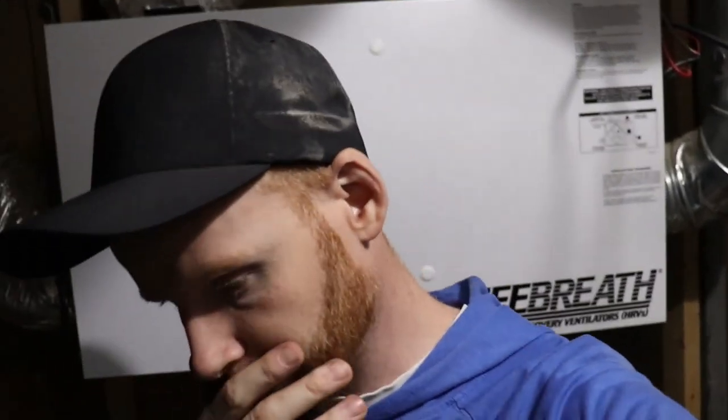But for all you people out there that have never drained your hot water tank, you want to do that at least once a year, potentially every six months. I haven't done it for 7 years since I moved in, and I didn't get that much sediment out of it. That being said, it doesn't mean that you shouldn't be doing it. Just to flush it out, it doesn't take that much. It's less than filling up a bathtub. Just drain it, flush it out, then you make sure that all that sediment and other buildup isn't in your tank, corroding it and doing anything harmful. So just get it out of there. It's easy, doesn't take too much.